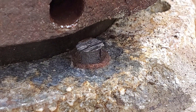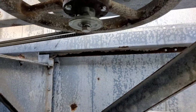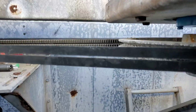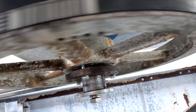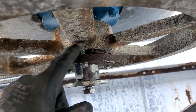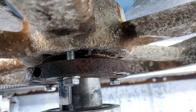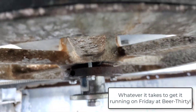I just ground those down. That steel is one with that aluminum — ain't coming out for shit. The local supply house didn't have any pulleys or tapered hubs for us. I got those holes a little crooked, it looks like — but not too bad. Drill and tap new holes. Right there's the old hole, all corroded — the old rusted bolt ain't coming out of there. So we put new ones in there. Ready for the fan blade now.